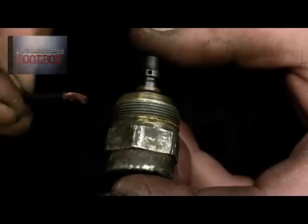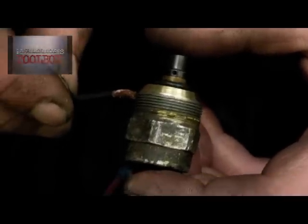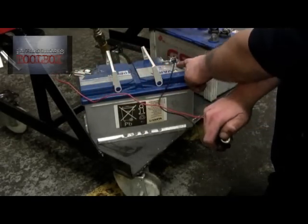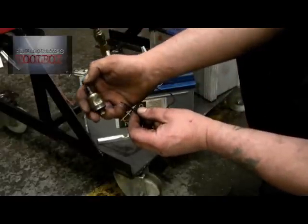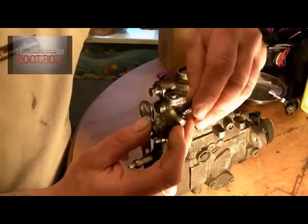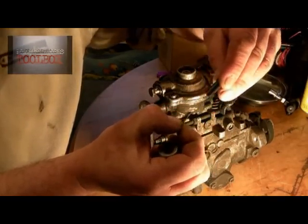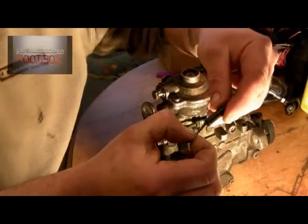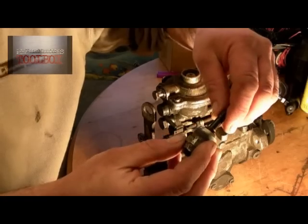By this demonstration I'm putting an electrical current to it — what I'm touching to the body is the earth, positive is connected. This fails in the shut position due to a little spring inside. Keep that in mind if you have to change it; you don't want to lose that spring, otherwise you might just get idle.